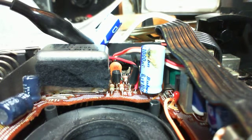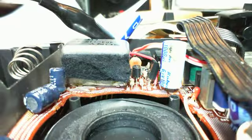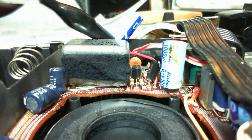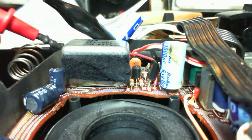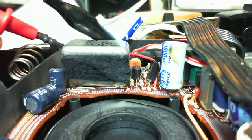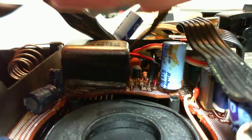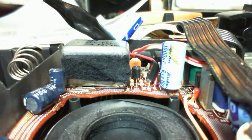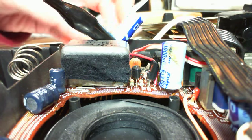Okay, batteries are out. 3 D cells. Radio's still making the hiss. Didn't hear any change in its operation. What the heck is going on? I'm going to read the voltage here now, which really should show up as the voltage of the power supply. That's interesting. The speaker is still making a hiss, and okay, I pull the power out and the hiss goes away.